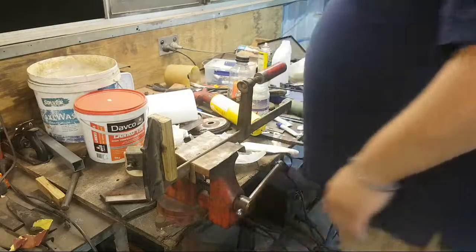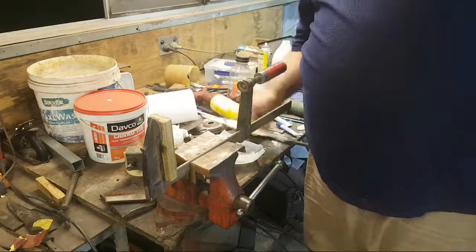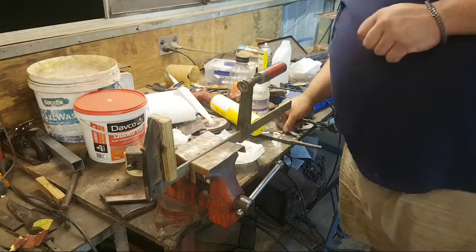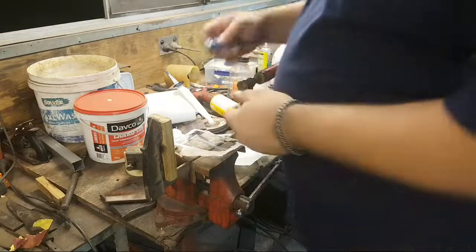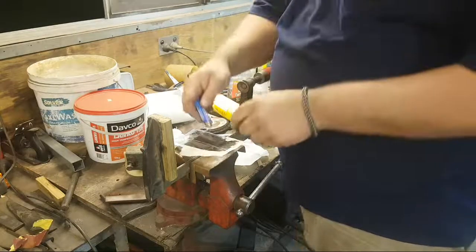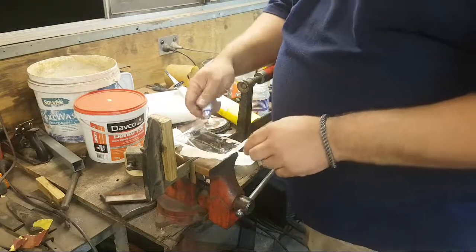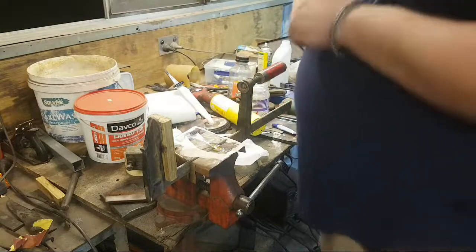Alright. So, the guard and the habaki have been oiled, so they won't have glue stick to them, which is good because that is always a concern. And now I've acetoned the tang, there's nothing that can inhibit the glue from that. I highly suggest setting up your gluing tray underneath where you'll be gluing, because there will be squeeze out, or there should be if you're doing it right. And you want to catch that squeeze out somewhere. And seeing as you already have a gluing tray full of glue, may as well catch the glue in there. Makes sense, right?